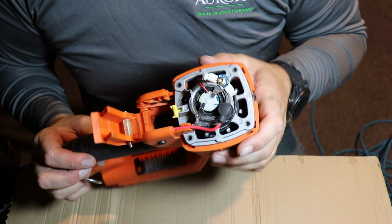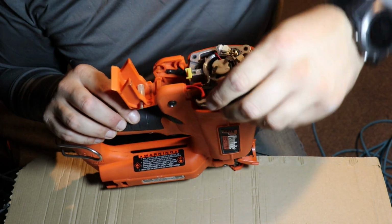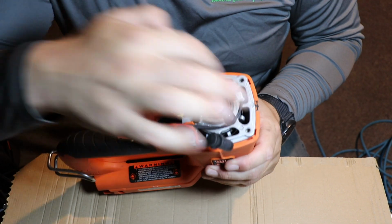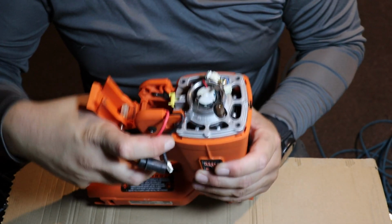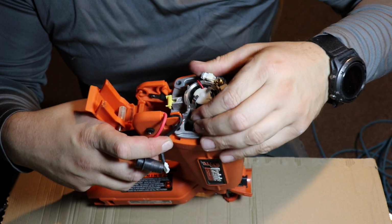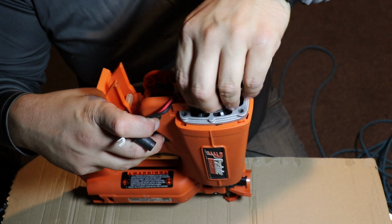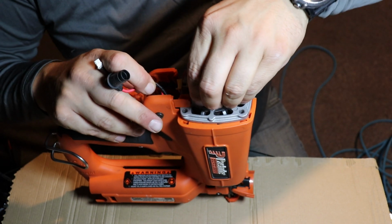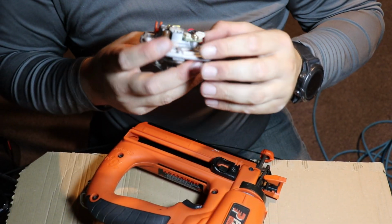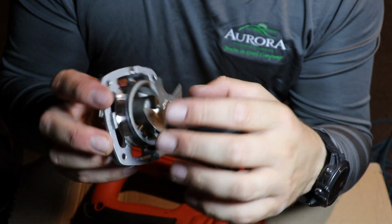So next, you're looking at the back here. This red wire goes to your spark plug. You can just unplug that, and it's actually meant to be unplugged. This black wire right here powers your fan. So you can take these off, just move them to the side. What you're going to do is then twist an eighth of a turn this whole assembly here. Just like that. And then what you're going to have is your whole fan unit right here.